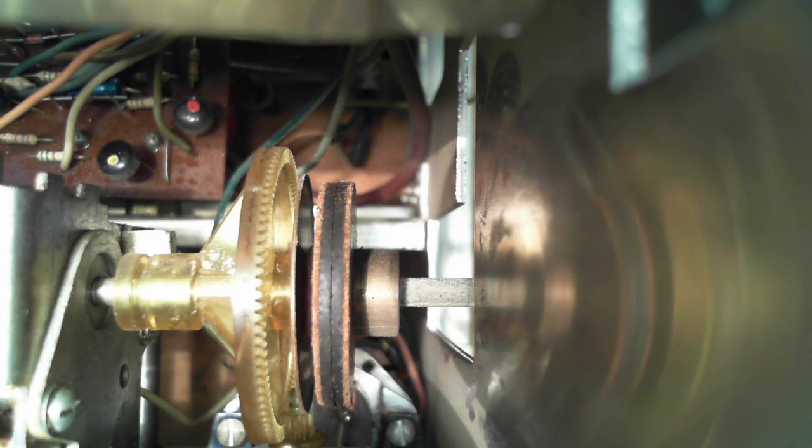Okay, so if that whole theory holds true, basically the yellow gear, the metal plate, and the one side of the clutch should all be somehow bound together. How would you bind them together? With glue? It's not typical that glue would be used. A lot of manufacturing issues with applying glue. It takes time to harden. The glue has to be applied exactly right. You've got a metal part in there you can't really glue to.